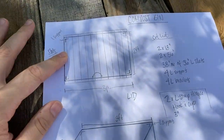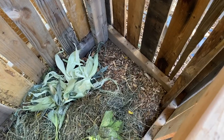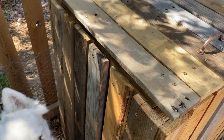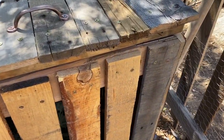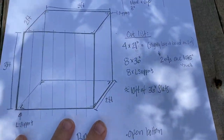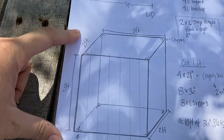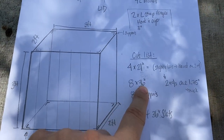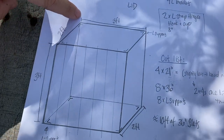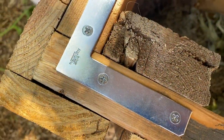I've got the lid up top and the base at the bottom. There is no bottom — you just want to make sure that you leave the base open. The entire outside is filled up with these reclaimed pallet slats, and the reclaimed pallet 2x4s are on the inside. The box is just three feet tall, three feet wide, and two feet deep. For the cut list, we have eight of the 36-inch pieces — those are all the three-foot pieces. And we have four 21-inch ones to make this two feet long, accounting for the thickness of the sides.